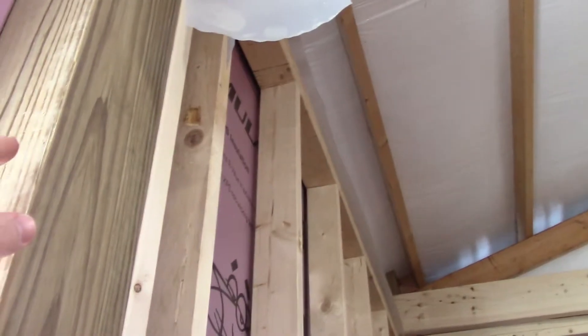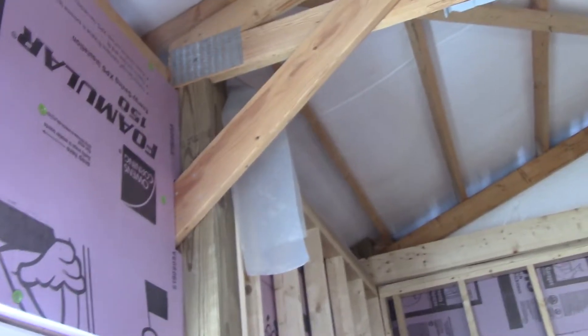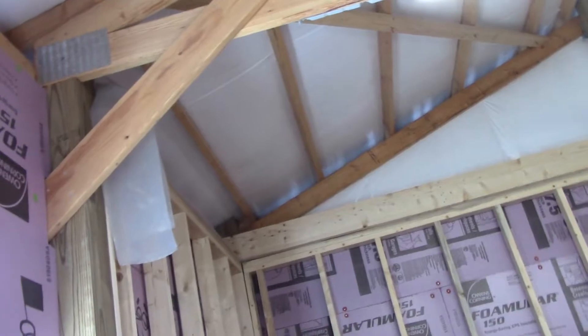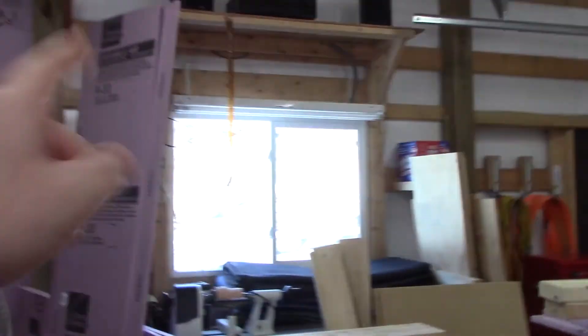I've had guys tell me to put a joist hanger here, but then I'm going to have to do something weird and wrap the joist hanger flange around, and I don't know that's necessarily the best way of going about it either. I think after the ceiling is all cross-braced together I don't think it should be an issue — I don't think that one particular ceiling joist is going to be holding enough load where it'll matter. The only other window is this one, but they did it right — they actually put the window in the middle of the opening between the beams, so I can frame that right and be okay there.